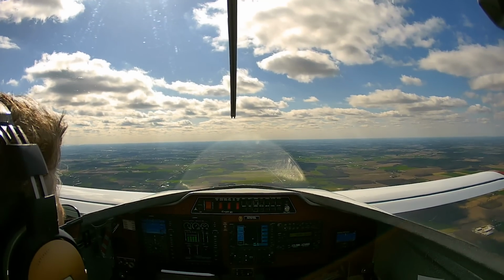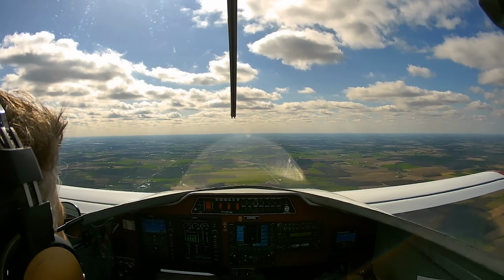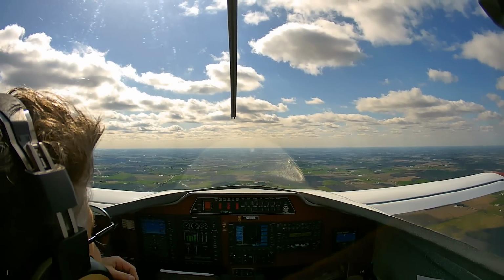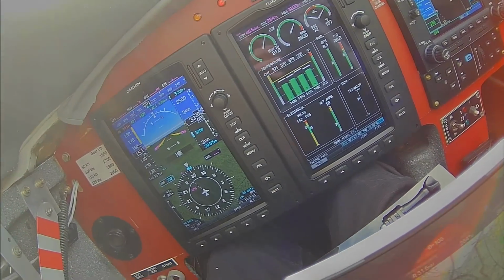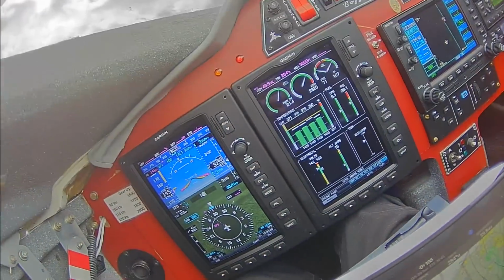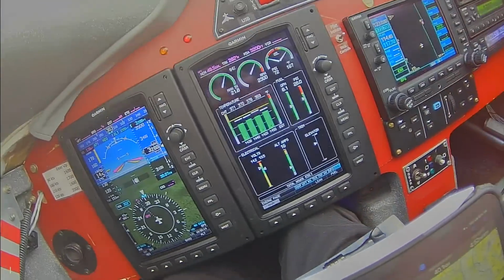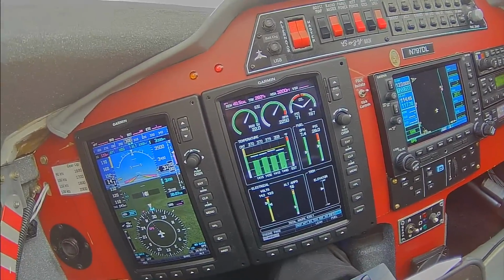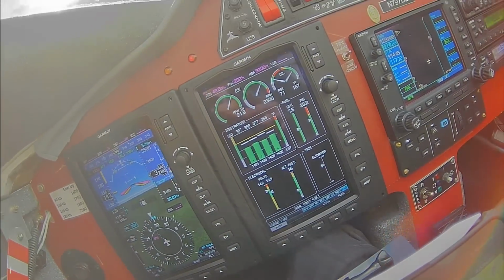So, I mean, it's balancing, but the overall cooling is not great, especially considering it's 38 degrees out. I just feel like I'm not getting a ton of air through there. Not quite sure why. You can see I'm cruising at an indicated 150 knots, truing out at also 150, 149. Well, it's varying because it's fairly bumpy today. But as you can see, I'm at 63%. I do have the mixture pulled back a bit, and my temps are around 360, 370, which is okay.